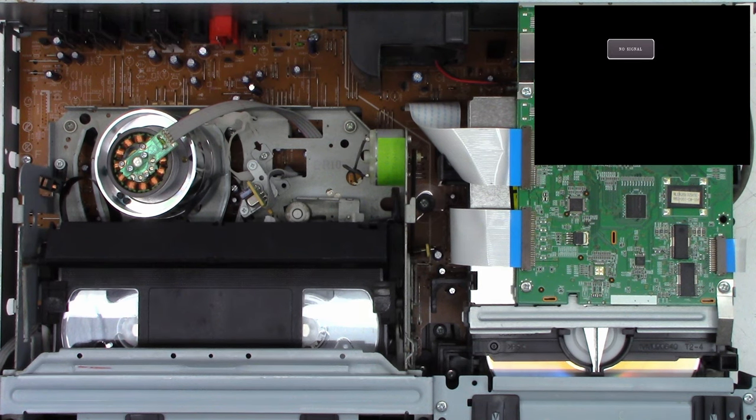Typically, these fail. They are in series. I only unsoldered one end. And 0.45, I'm okay with that. Nothing on the pad. And 0.67. On a 220, that checks out in my book.